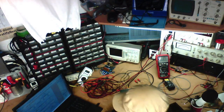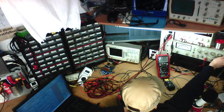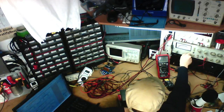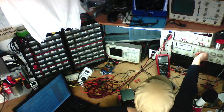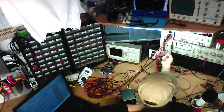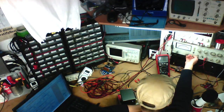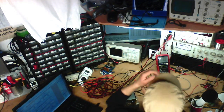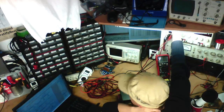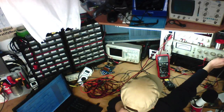Right. 100 hertz test was okay. 1 kilohertz test. And that should put us steadily back at the -4. I've done something wrong. My reference is screwed. Ah, Christ, I have the load set to 4 ohms for a couple of tests, so I have to redo everything, redo the entire frequency response test. Blech.